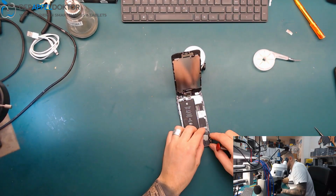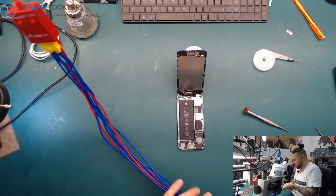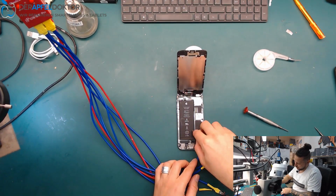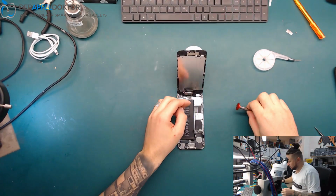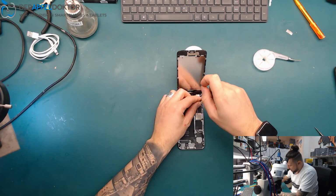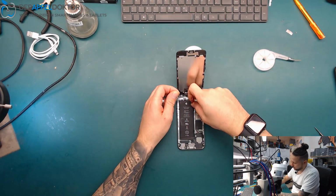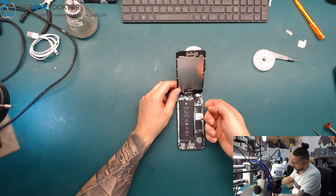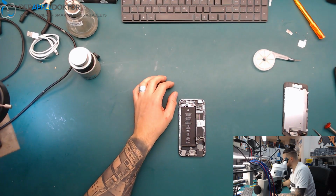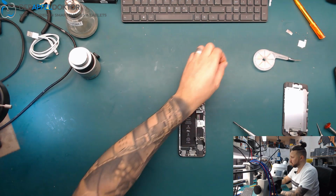So let's see what we got here. We check out the battery and just see for short at first. Yeah, we got VCC main. Directly 5 amps if I connect the battery FPC or the battery to the FPC, the iPower box. And now let's have a look how hard this water damage is. Often when you see VCC main, okay, it's fast money, just one cap, knock it off, get the data and you're ready. But sometimes you remove one short and after that you got the next three. So let's have a look if this is a fast job or not.